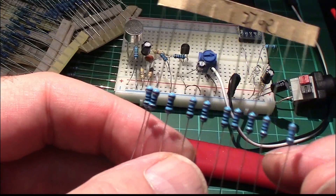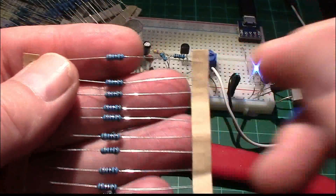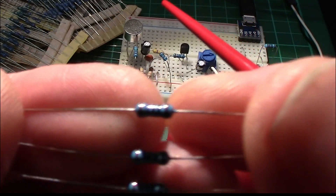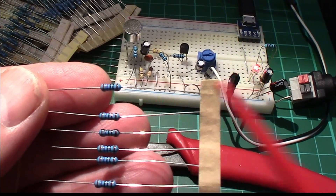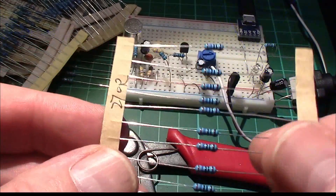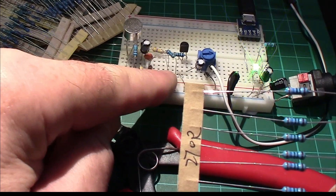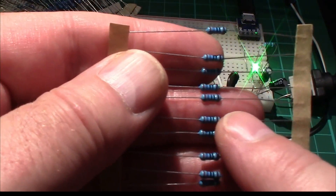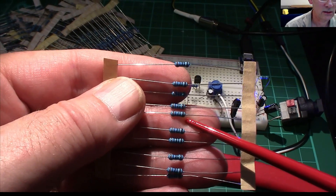For me to read these I just can't — I don't know which end to start from, although some values become nonsense if you read from the wrong end. I just can't use them confidently in my projects. I might actually have used a 1k one down here, but that doesn't look like a 1k to me — for one thing it's got too many bands, and the red on here looks more like a brown. It's only when you see the actual brown that you realize the red is red rather than brown.